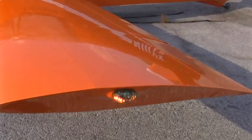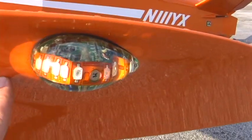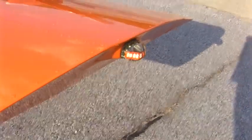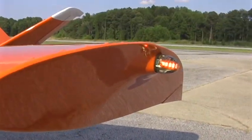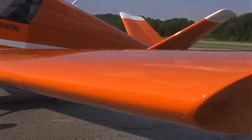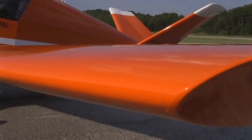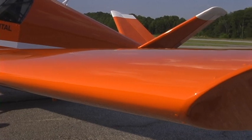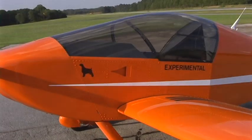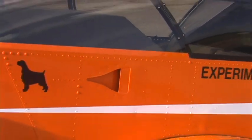Here's the Aveo flashes — they were on the first video. This is actually an RV part, a wingtip extension, fiberglass, goes in there real nice. Another thing I did was fill in the flush rivets with fiberglass filler to make a nice smooth leading edge. Got the large NACA vents, which do really well in the south here on a hot day.